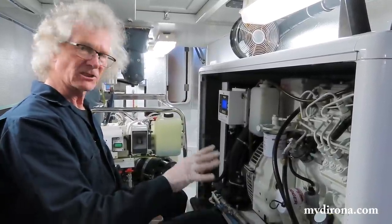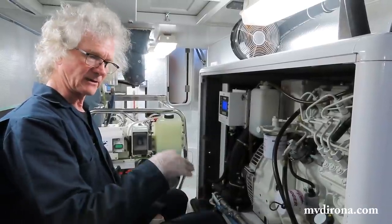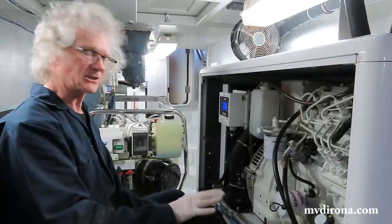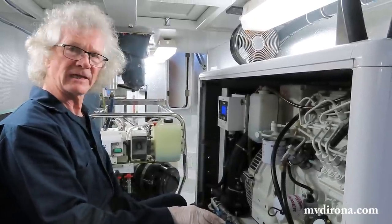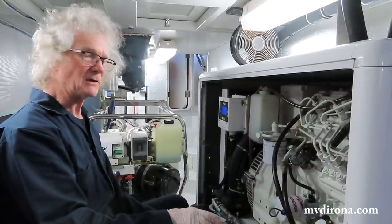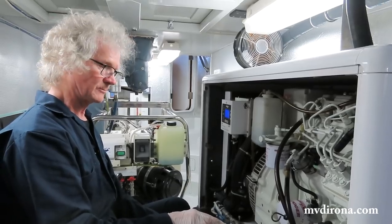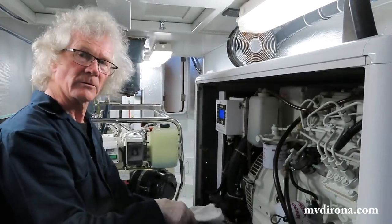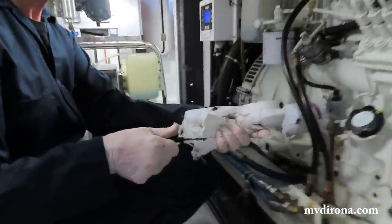And so it's a concern. You do not want to hear an engine in good condition turn a couple cranks like that before it starts. It should start up instantly. So that is a concern, and it wasn't like that a few months ago. So it's something that does need attention, and I'm going to look at it. And that's the fuel level in the supply tank, not our main tanks, right? Correct. Yes, correct.